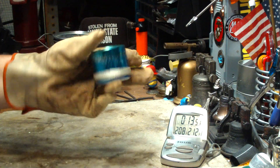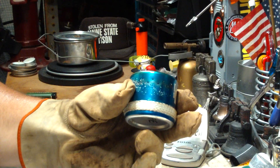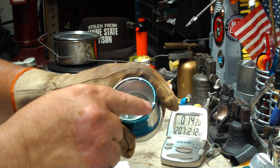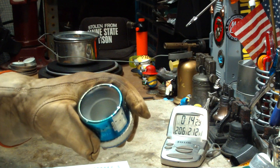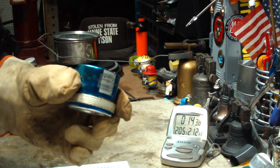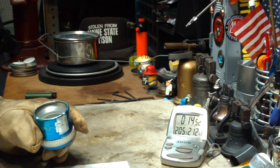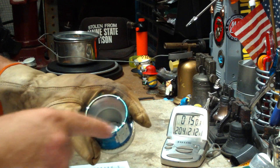That was with one fluid ounce of methanol. It has 30 jets on this in two alternating rows — I hope you can see them there. Sam put grooves on the top here. I think so that pressure can't build up inside and force the alcohol out through the jets. You've seen in some of my older videos where I've had to put a hole in a stove just so it doesn't do that — sometimes it'll build up pressure and push the alcohol out and make a mess. It looks like what Sam did was put little filings there.